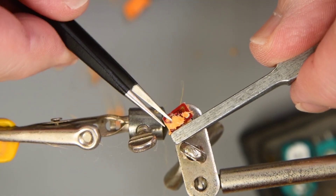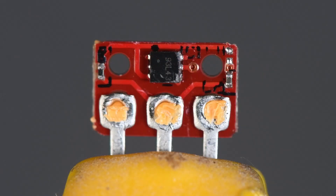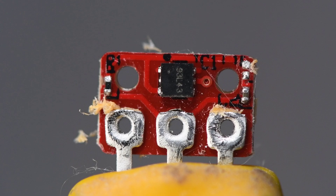Here is the L3J board. It has a resistor on the left side and two capacitors on the right, and this is by far the slowest of the HAL sensors. Here is the L4A board — it has a resistor in the same location on the left but only one capacitor on the right. The L4B board is identical to the L4A board. I will try to check the values of the resistors and capacitors, though they are just so tiny I'm not sure how well that will go.